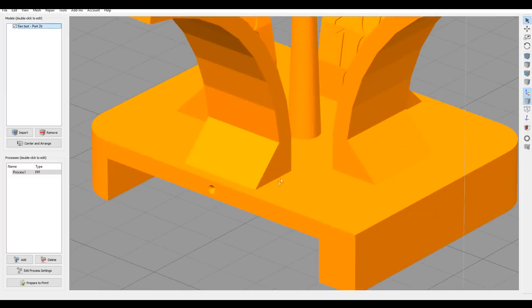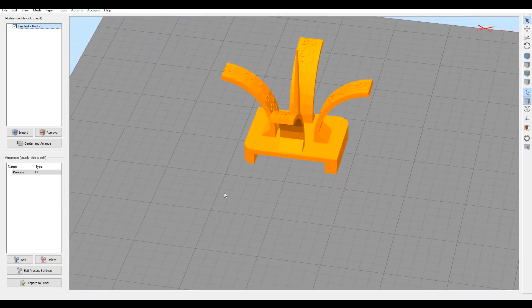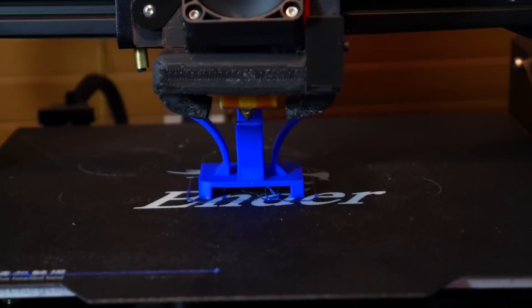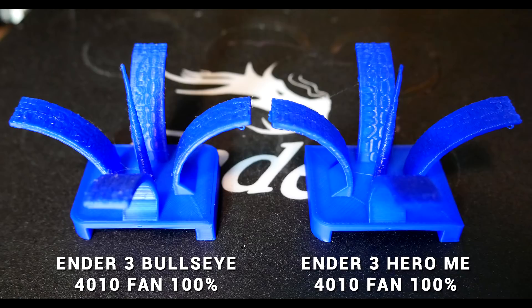Time for some printing tests. Here's my torture test — the link is in the description below. The whole base is a wide bridge, and then there are four towers, one in each direction, that go up to an 80-degree overhang, and a skinny central piece in the middle. I once again ran the exact same G-code as the previous test to make sure that it's fair, and I'd just like to point out how pretty the blue is of this X3D blue filament. Our torture test is printed, and the results are extremely similar to the Bullseye design. When you look from the top, although we're using the same G-code, you'd be hard-pressed to know any change of parts had occurred, even down to these tiny little loops and imperfections.